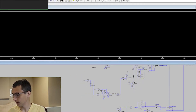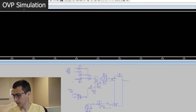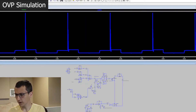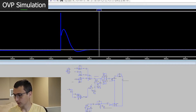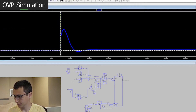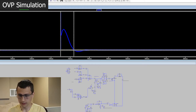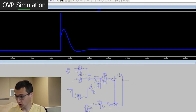I think we have almost identical inputs to the system — let's just make sure. We've got basically the same voltage input, and we've got a current signature that will look very different. You can see there's no overcurrent protection, there's no clamp. So when we apply that load step, we see a peak of 120 amps and a much longer transient — we are above our 10-amp set point for about 13 milliseconds with a peak of 120 amps. That would blow up our FET for sure, which demonstrates the value of our overcurrent protection.